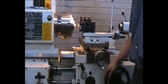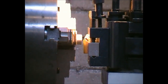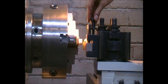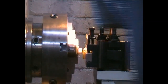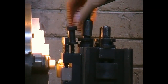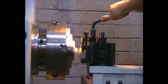We visually inspect the height of the tool so the tip of the cutting edge is in the centre of the part being lathed. If this is not true, the set screw at the top can be used to pull it either upwards or downwards. Please ensure when it is tightened that the tip is visually in the centre of the part. Please tighten the tool holder tight into the tool post.